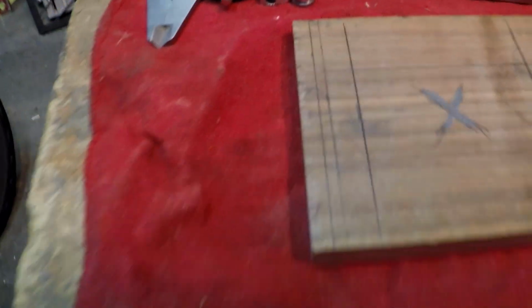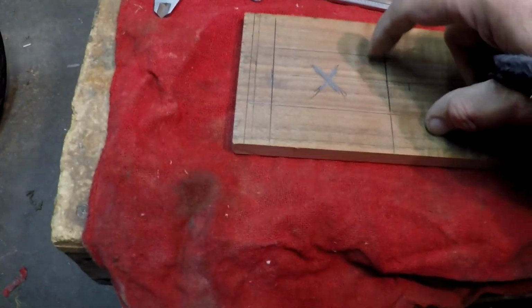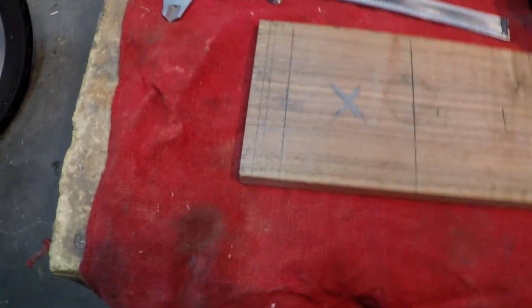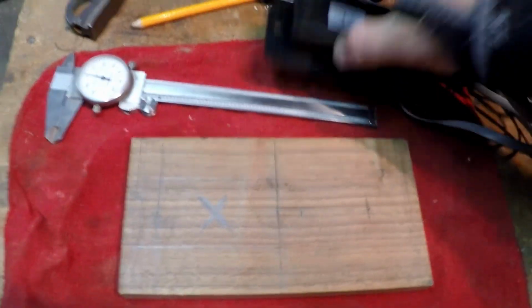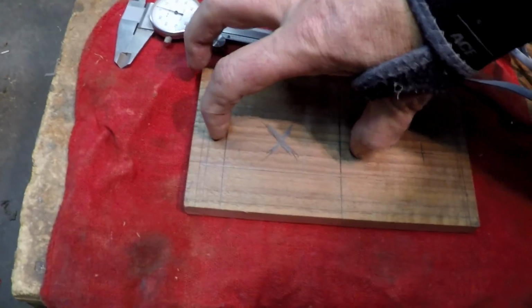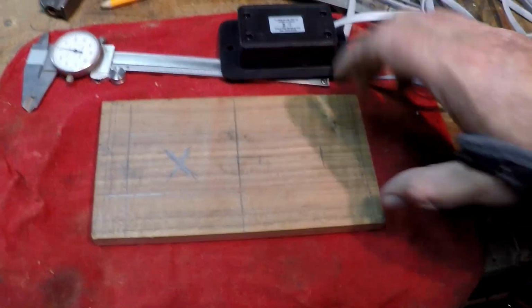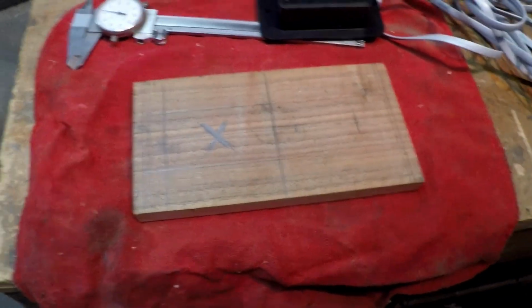This right here, I'll use a little jigsaw that I've got to cut those out, but I'll start by putting some holes in each corner. And this one has a little more room, so I don't have to be exact. I'm probably going to cut right on the line. That way I do have a little bit of wiggle room. I can lay it in there. Once that's done, I'll figure out where I'm going to put the screw holes. I'll pre-drill those, and then I'll also pre-drill the holes for mounting it to the wall on the trailer. So I'm going to get set up. I'm going to do some of that, and I'll bring you back when I'm a little bit further on.